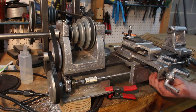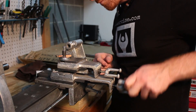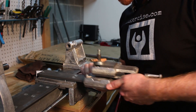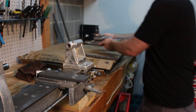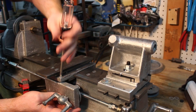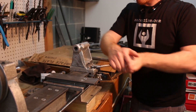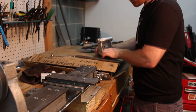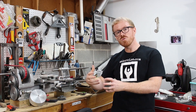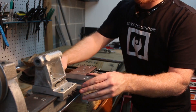In part 11, we took a look at the lead screw drivetrain, and that'll be very helpful in this process of boring the tailstock. I disassembled the cross-slide and the apron, and then I removed the tailstock and the carriage. That way, I could put the tailstock on first and have the carriage on the right side of the tailstock, which allows me to move the tailstock along the bed using the lead screw.